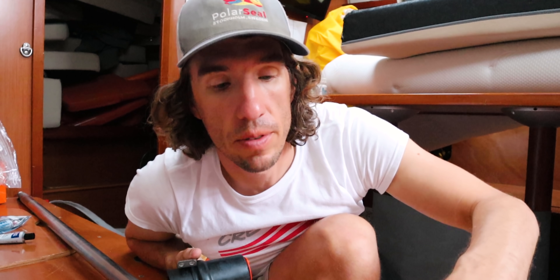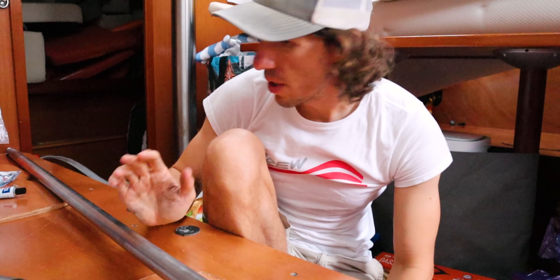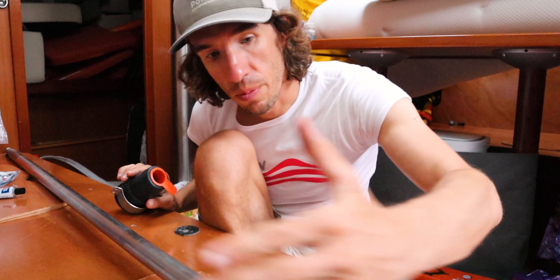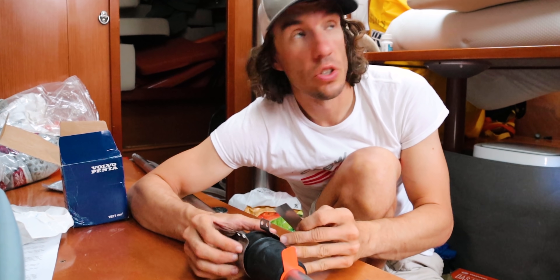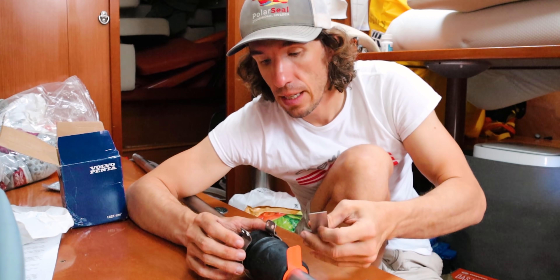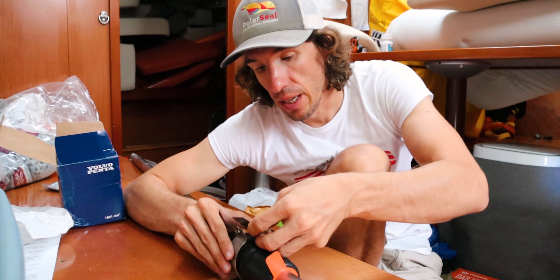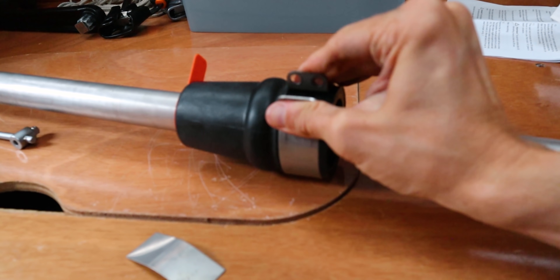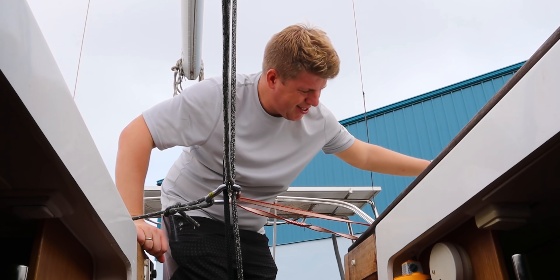Because we had to pull the shaft out from inside the boat — since I couldn't get the coupling off — the coupling attaches the shaft to the engine gearbox. When I put this on, it won't be going in the traditional way the instructions describe, so I need to think it through. The shaft is going out of the boat from the engine, and the seal piece is on the inside. We've inserted the rubber protector and put a little grease in. We're going to install this as soon as it stops raining, because we need to lift the engine. You need to avoid pinching the rubber piece when buckling down the metal plate.